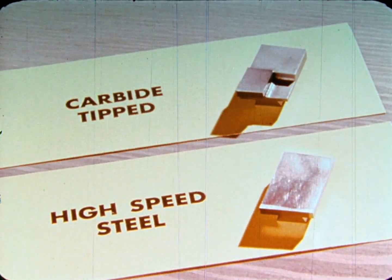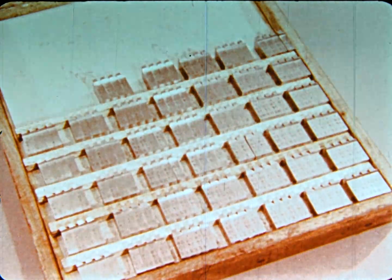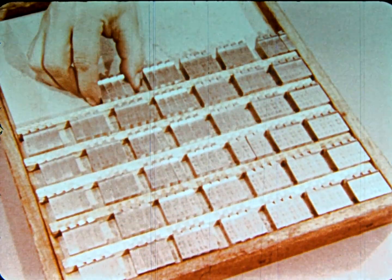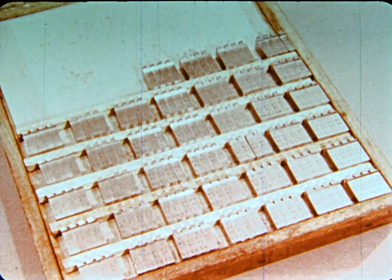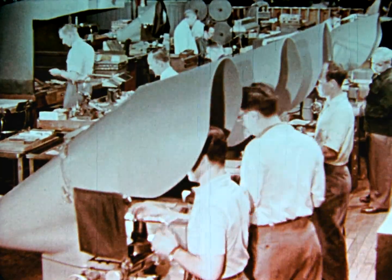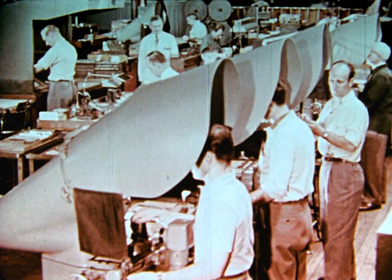For maximum quality in chasers, every surface should be ground to close tolerance, such as these supermetric chasers. Precision grinding of every surface pays off in terms of smoother action in the head, longer life, and more accurate threads. In the inspection department, chasers must pass under the watchful eyes of experts trained in the science of inspection.